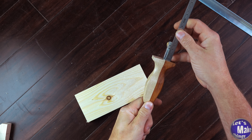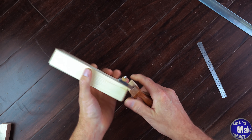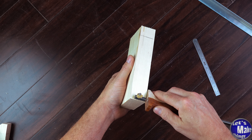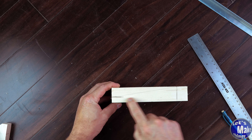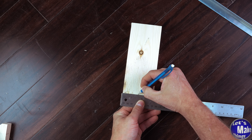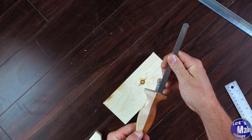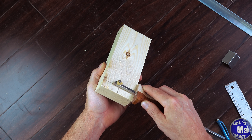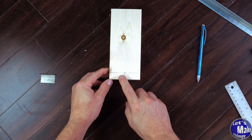The first thing I'll do is set my marking gauge to an inch — you don't have to have a marking gauge for this but it's a little bit easier. I'm going to come to the side and make a mark. Now I'll set this to a half inch and make another mark on the other side. Now I'll connect these two marks and I've got this little slope to cut out with the band saw. Before I do that, I'll come to the center — this is three inches, so I'll add an inch and a half, put a mark there, then set this to 21/32nds. I'll draw a line across, extend it out, and that's the corner I'm going to cut out with the band saw.